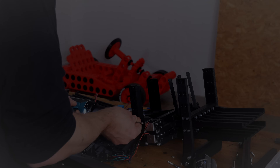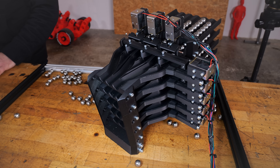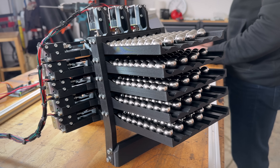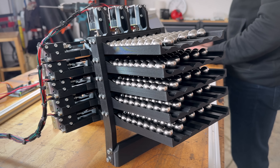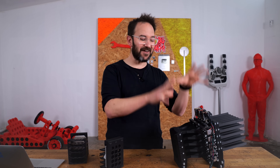And by 'a second' I mean like three or four hours. Just 105 M3 screws, 30 M4 screws, 10 M5 screws, and five brackets for the solenoids — everything went in in order, so we are ready to try again. I'll try releasing one marble from each channel just to see if anything is getting stuck. From the front it's difficult to see, but if we look at the input trace at the back, we can clearly see it is working perfectly. And of course we can make it go faster. Looks like we now have a proper marble selector.